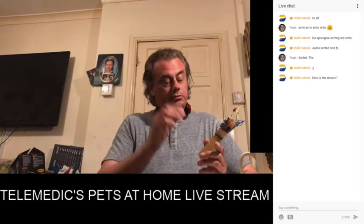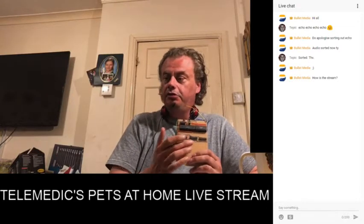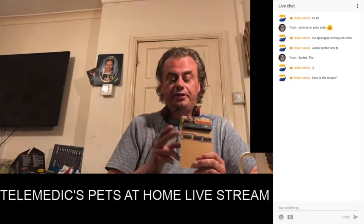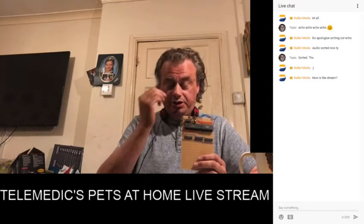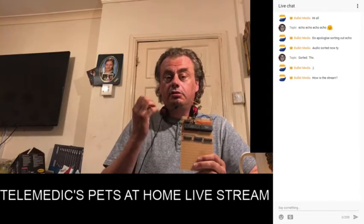So we will be looking towards sharing these two buses, address and data buses, one for the video and one for the main CPU. So I've got some 74LS245 address buffers here, which can be switched to a status where they don't exist, and they'll only come in when necessary, when we've got them at 32768.